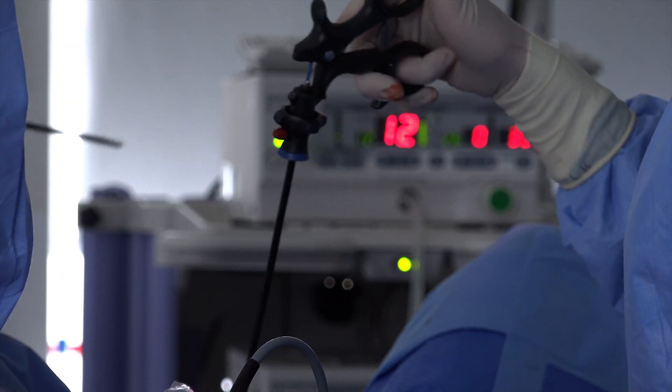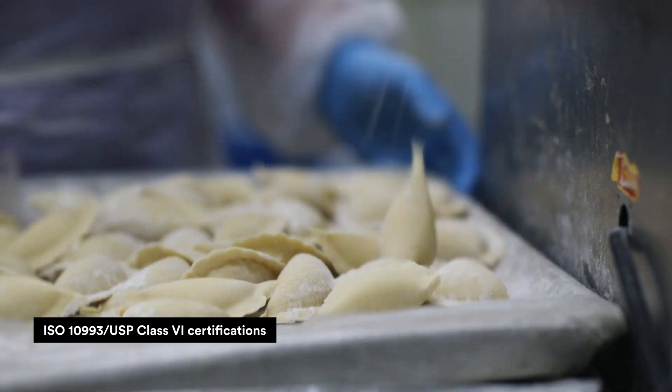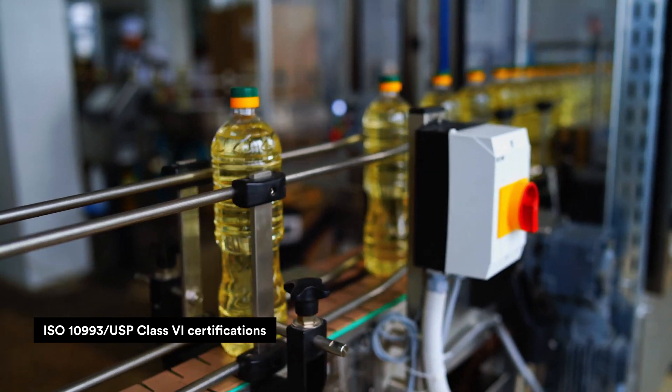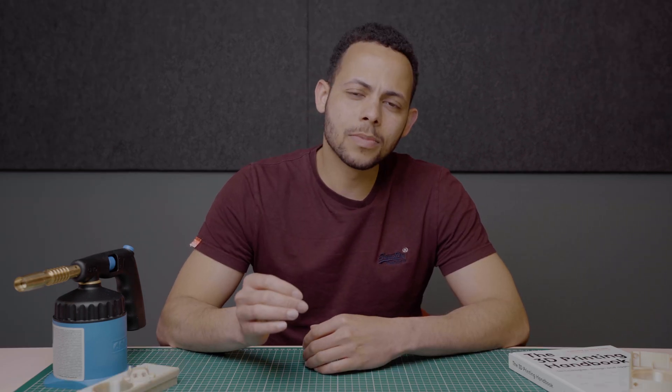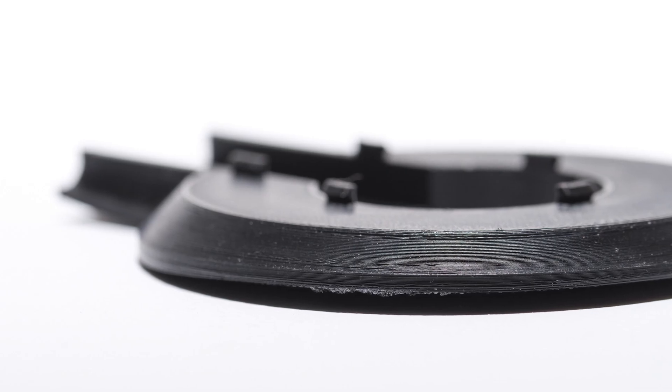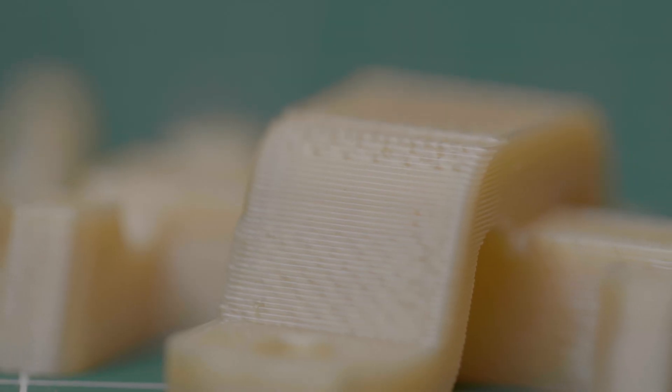Lastly, unique certifications. The certified grade of this material is biocompatible and approved for food contact with NSF 51 and ISO 10993 USP Class 6 certifications. That means you are able to use it in parts that handle food preparation or even put it inside the human body. Good to note is that Ultem is the only FDM material that is NSF 51 certified. However, keep in mind that FDM printed materials have layers, which means a lot of surface area for bacteria.